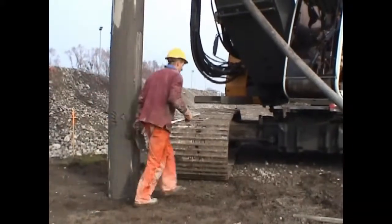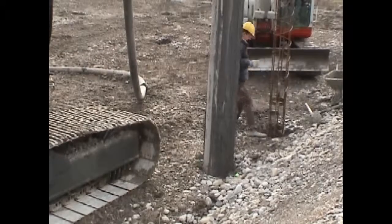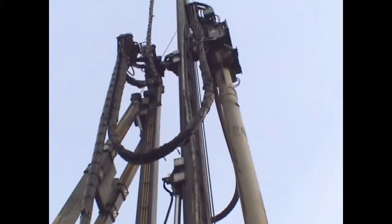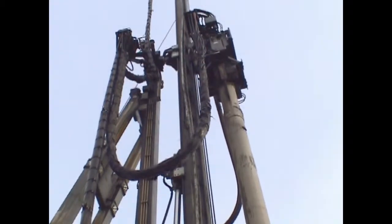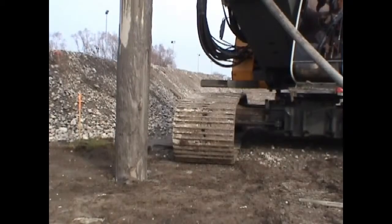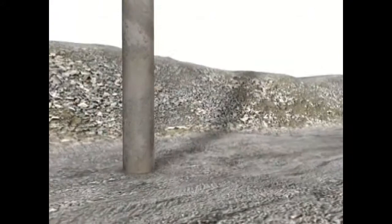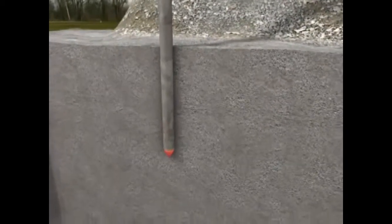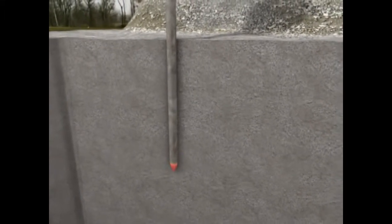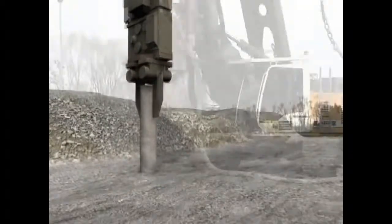The piles are installed in two phases. The steel casing is placed on the cover and vibrated into the ground down to bearable soil layers with the help of the rope crown system. Below the cover, a wedge is formed, displacing the surrounding soil and facilitating the penetration of the casing. The pull-down force exerted on vibrator, casing, and cover through the basic machine enables the whole system to get into a harmonic sine wave.